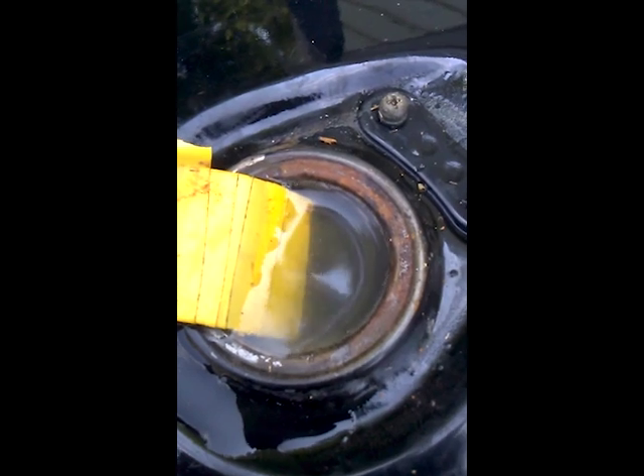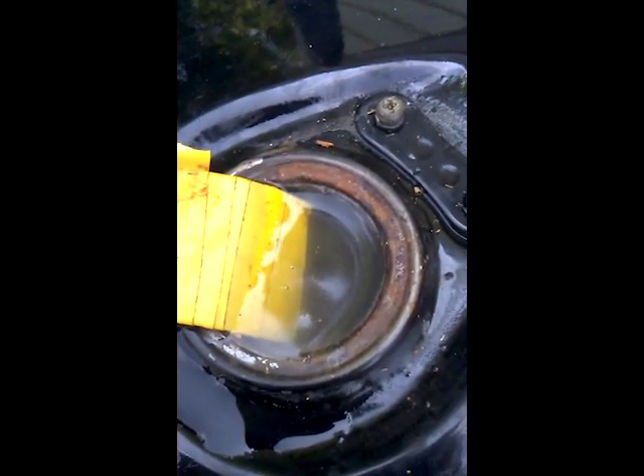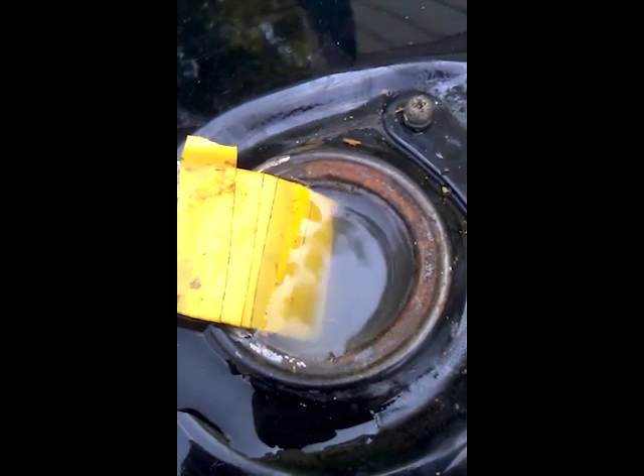I've done it a couple times now. There's some rust deposits all over. This is new rust from this morning that hasn't dried yet. But we're going to go ahead and connect this up. We'll be able to tell that there's current running because we'll get a few little sparks as we hook it up. And then we can look right down here and see — I'm starting to see bubbles. And that means that our electrolysis has begun.